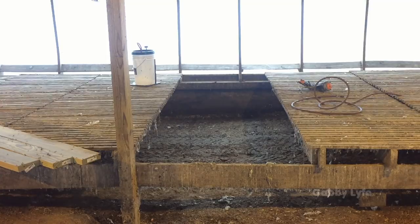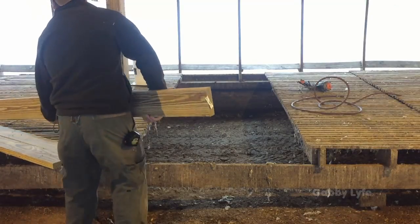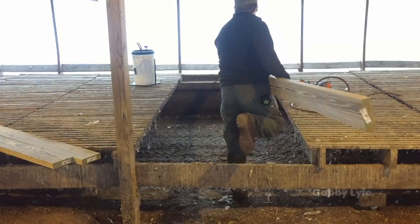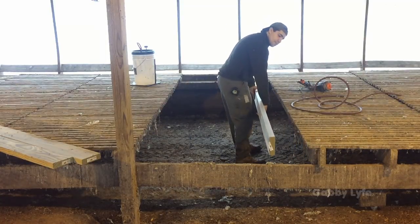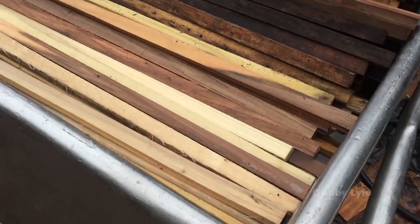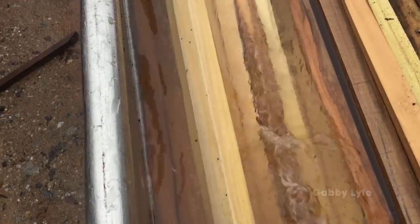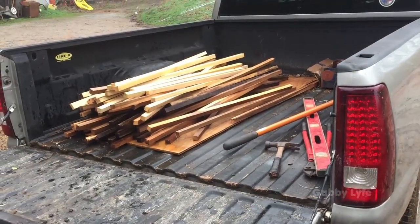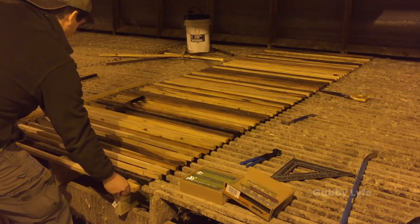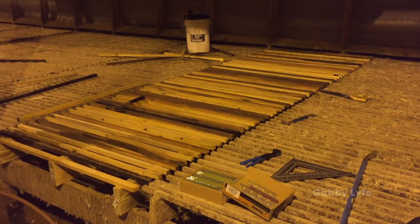But along with replacing single slats, it's sometimes necessary to replace whole slats because they are damaged beyond continued use. These whole slats are 12 feet long by 4 feet wide, and on top of the 3 2x6 12-foot footers are 50 one-inch by four-foot single slats, with three quarters of an inch spacing in between. To prevent splitting while nailing the slats, they are soaked for at least 24 hours. This year, I've made about three slats in various parts of the chicken house. Also note that this style of slats is a very old style, since this house was made in the 70s.